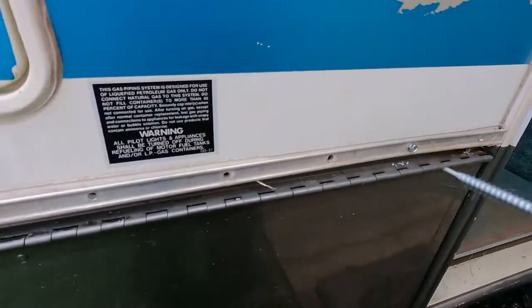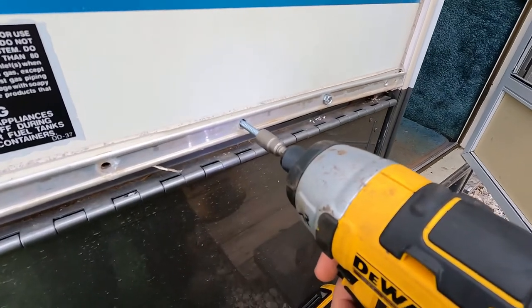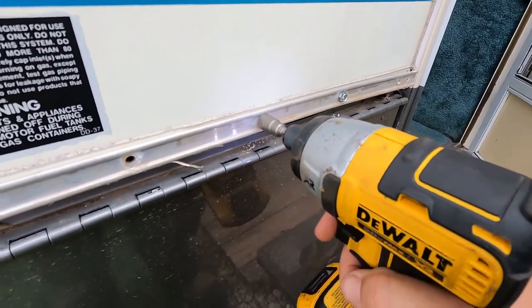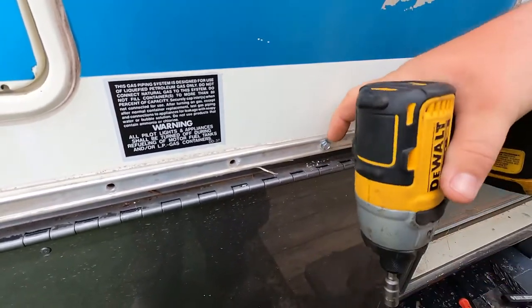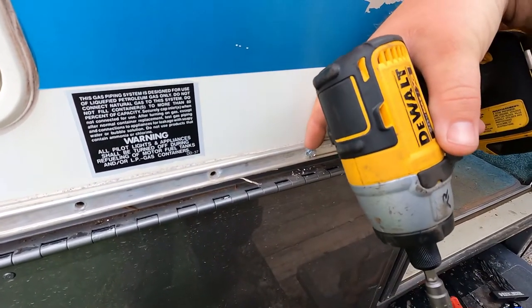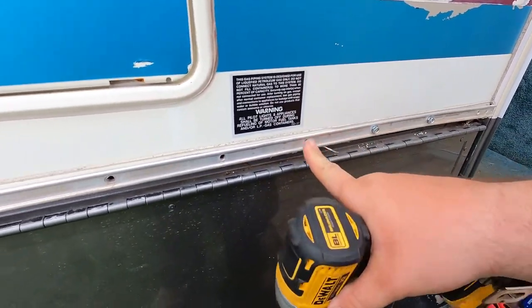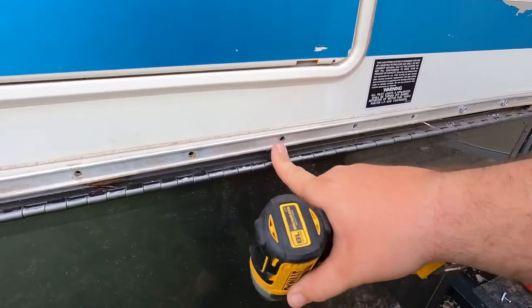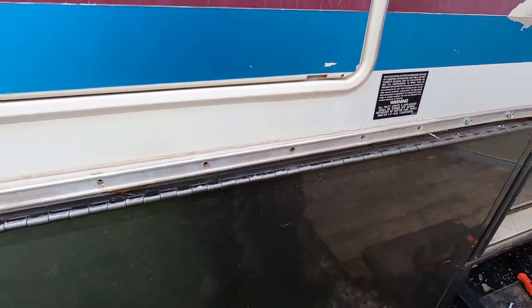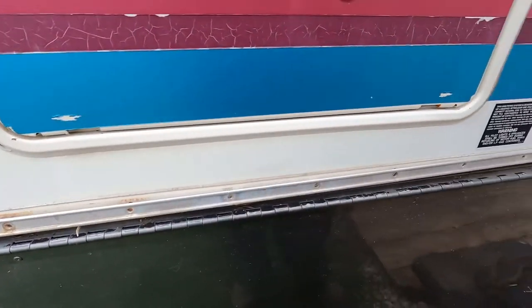So we've got the door on with a couple of screws. When you get it right, it'll actually go in fairly easy. You want to get it tight with no play, but you don't want to suck them in because it makes it really hard to get the trim to go back around the ledges. So you want to get them tight where there's no play, but you don't want to suck them in to where it bends and crimps so you can't get your trim to go back on or look right — because it could have waves all the way down through there.